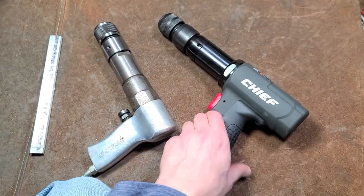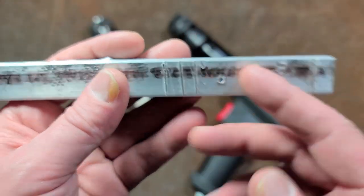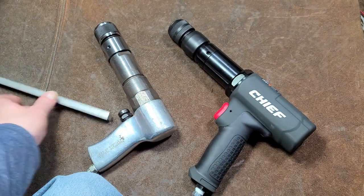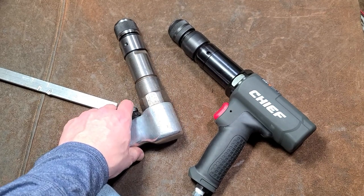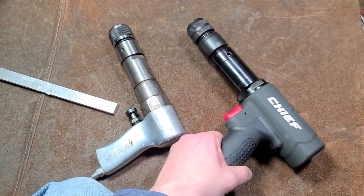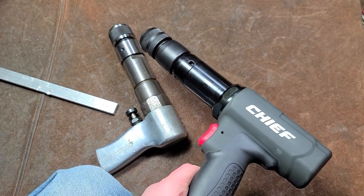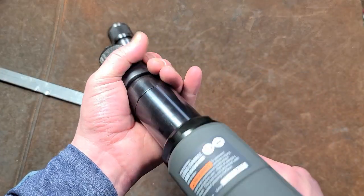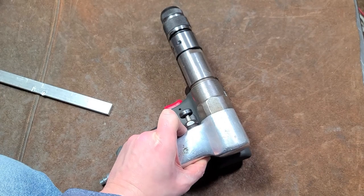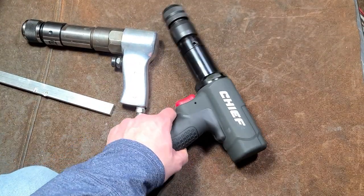To tell you the truth, I was actually kind of hoping this would have just cleanly beaten the Marflow, where one of the cuts was just way deeper - maybe 50% deeper. I was hoping this thing would just cut right through this piece of aluminum on a block of wood. That wasn't the case. Even though the Marflow doesn't quite have as heavy a hammer, it swings at a much higher rate, so even though they're smaller hits, it's getting more hits in the same amount of time as the Chief. The Chief may be better on really stubborn bronze bushings or heavy equipment where you just need the most mass, even swinging real slow.